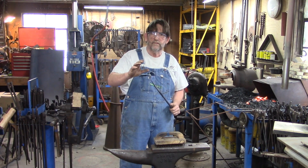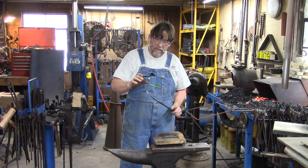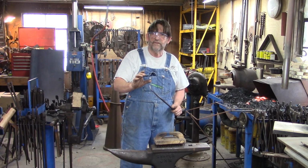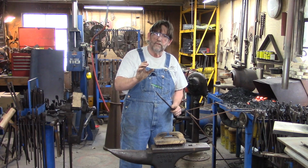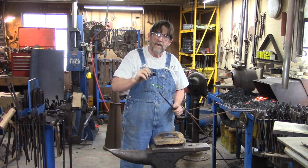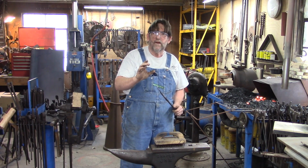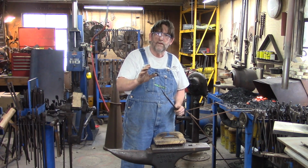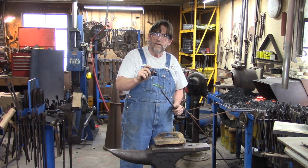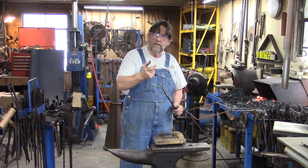The main thing that affects the body of your leaf, and we'll get into that in the next video on folded leaves, is the length that you leave that full and the length of your taper when you start. The longer lengths you have, the longer your leaves are going to get. I have people ask me, why do my leaves end up so long and skinny? Well, the longer your bud, what we call the bud, the longer your leaf is going to be. The shorter you have that main section where you haven't tapered from your taper back to your stem, the shorter and wider your leaf is going to be.